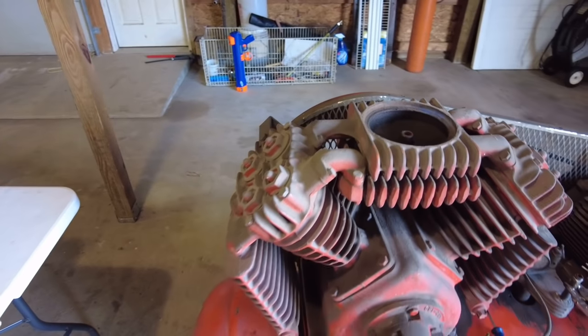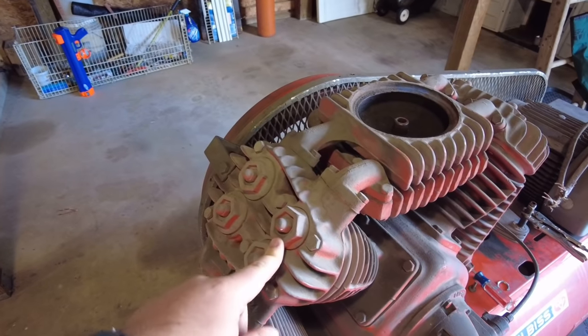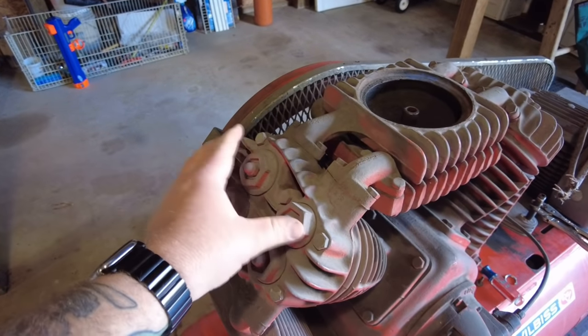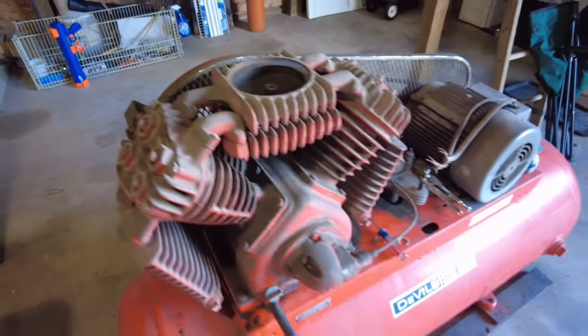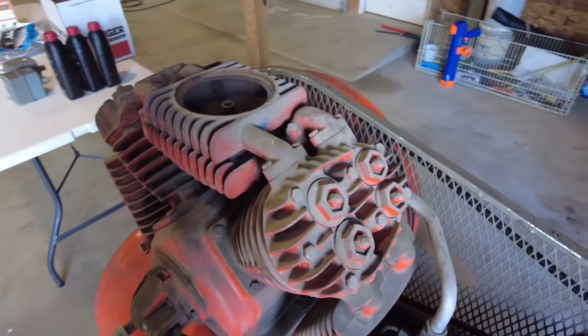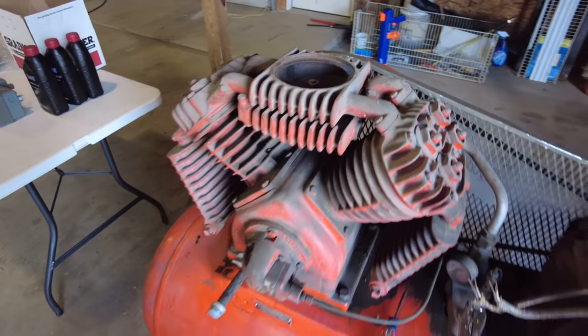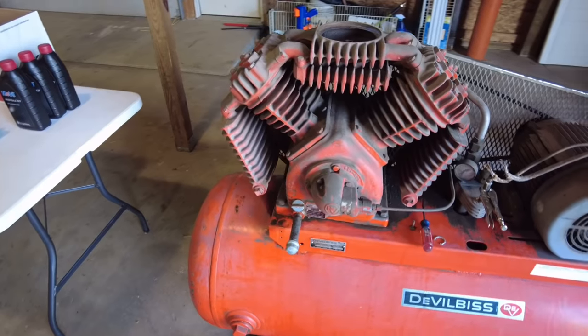So down the road, I'm having a feeling that I'm going to at least need to take the air inlet and the check valves, the intake valves and stuff apart on the tops of the heads, to at least go through those, check out the valving, and check out the spring retainers on those, because I bet you they are quite nasty and pretty much junk.